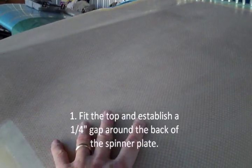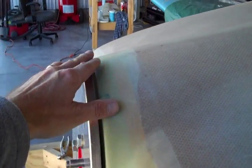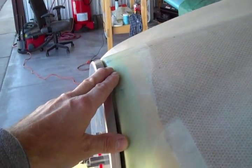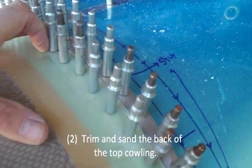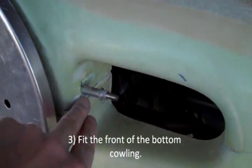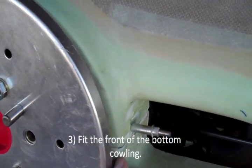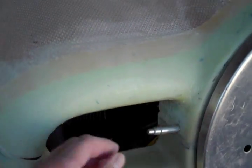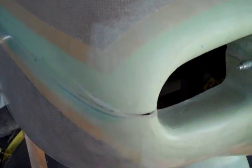Top piece first. Take care of this gap here — this one-quarter-inch gap. I use the magazine method: there are like four Vans accessory catalogs under there holding it in place. Get your gap squared away. Have the hinge go. Cut this front off here so that it can fit together. Clean this up so that these can fit more or less together. This is my next big project — there'll be a lot of work on this connection — then set the bottom cowling.